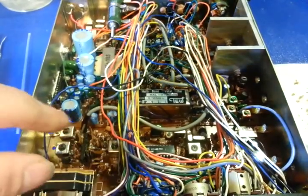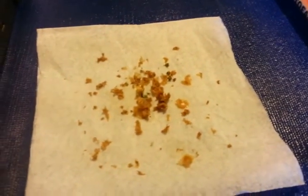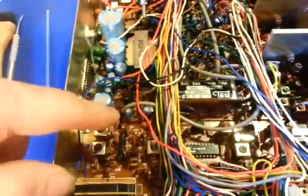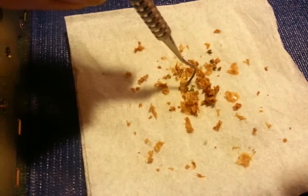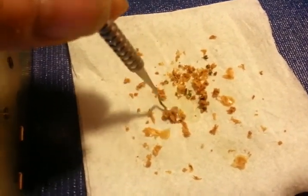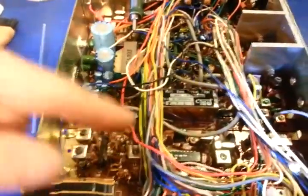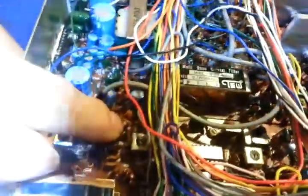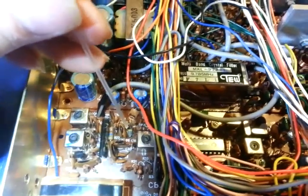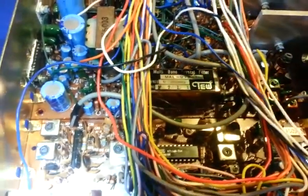I just spent almost an hour cleaning all the Sony Bond — the entire VCO area. Everything in here was covered in that old Sony Bond glue. I've been chipping, picking away, and dissolving to get it all out of here. Some of it is dark brown where it started to decompose, and when it does that it becomes conductive — basically turns into a resistor — and also becomes very corrosive and will start to eat the leads off everything. You really don't want that in the VCO area because any shorts will completely throw off your frequency. There's a Varactor diode down in there that was completely encased in that stuff, and that's one of the areas where it was starting to turn brown. All that's been cleaned off.